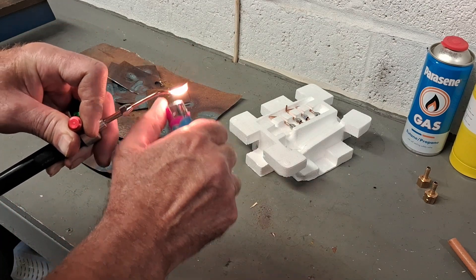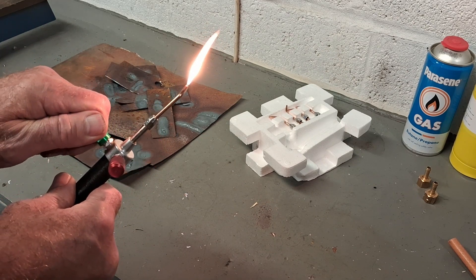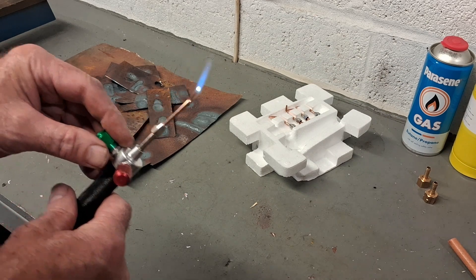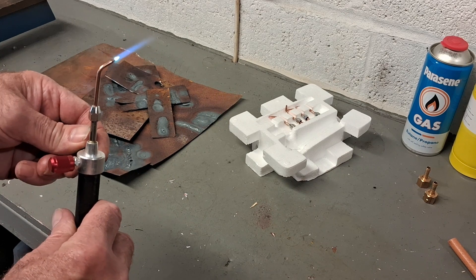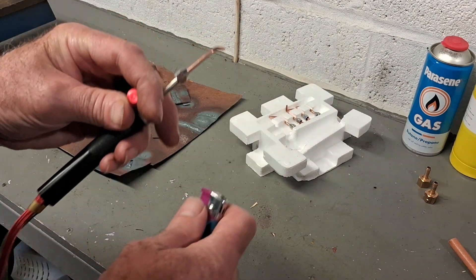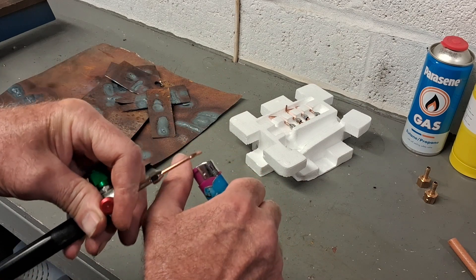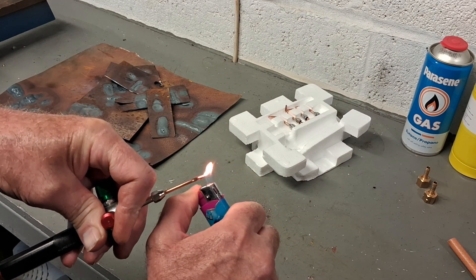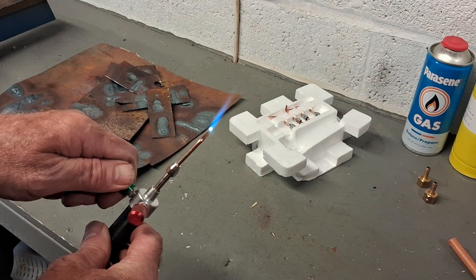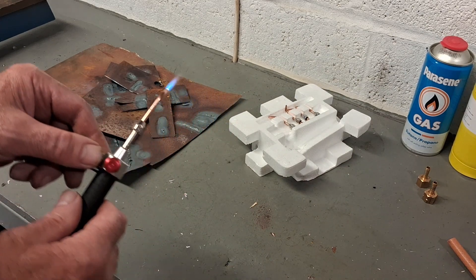Okay, acetylene on — yeah, pretty little flame. A little bit of oxygen — real oxygen from the cylinder — yeah, it's a lovely little flame. We'll just turn that off and give it a little bit more pressure on the cylinders. I've just turned it up to about seven on the oxygen cylinder and we'll see if that gives us any better flame. A bit bigger — yeah, that's a little bit better. We'll see what it's capable of on the metal.